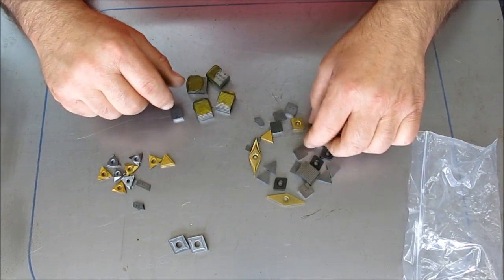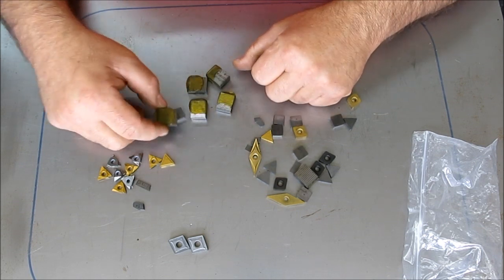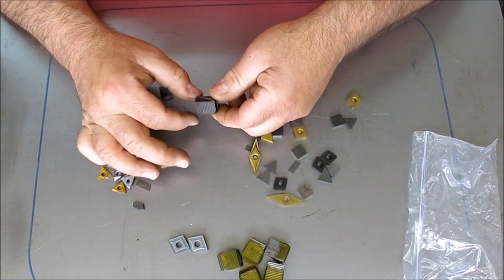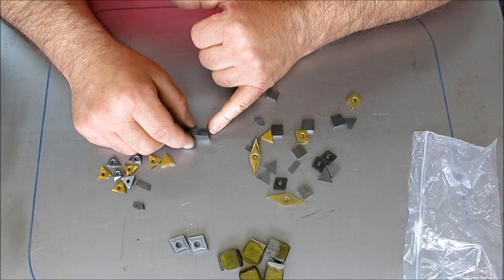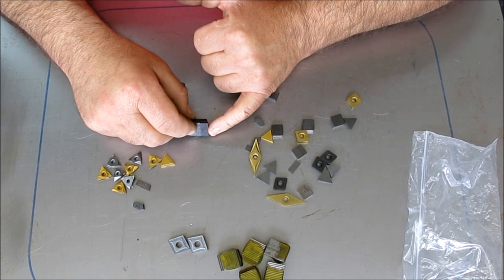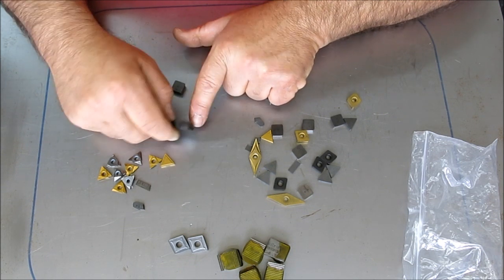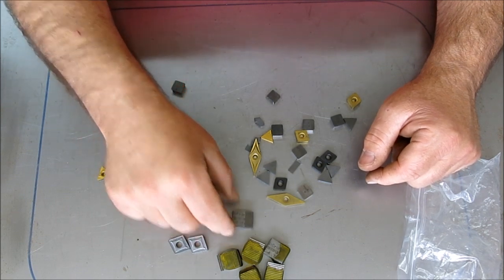What else we got? We got these. These are some kind of grippers here. So these look like jaws for a vise, or they're kind of serrated like they're gripper jaws. And so I don't know, maybe some kind of pipe clamping thing or something like that. Oh, there's one that's got the rubber off of it. Oh no, okay. So this is steel. Oh, okay. I misread that there. So this is steel with serrations, and then it has a carbide cutting tool brazed into it. So this is some kind of big, scary grooving tool or something that looks like you can index it a little bit on these notches, perhaps, or else that's a registration feature to keep it from moving around in the holder. So kind of neat.